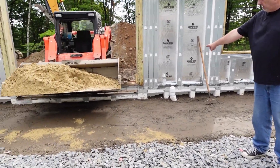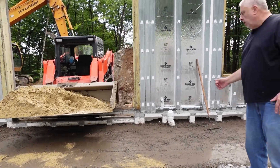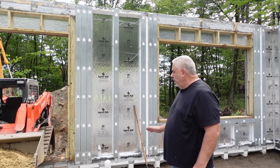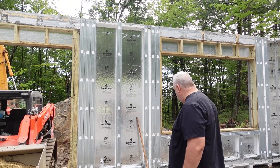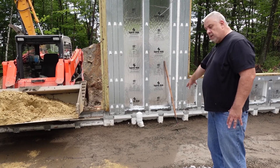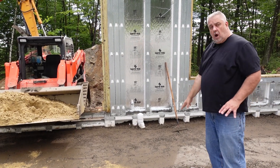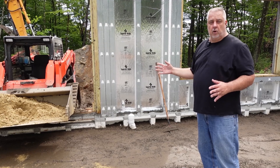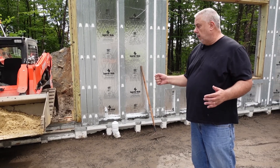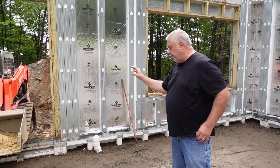Notice underneath this doorway — you can see there's a giant opening there. The issue is they had to be able to transport that panel for the door, but the door actually goes down into that lower set of panels. You can see there's a seam line where we basically have a four-foot frost wall system down below and then we have our ten-foot panels rising up above, so all in all we're at about a fourteen-foot Superior Wall system. That little ledge in there was only to provide rigidity during transport — that'll simply get cut out and then we'll have the appropriate rough opening for the door.